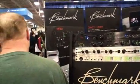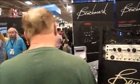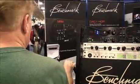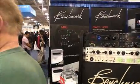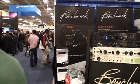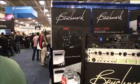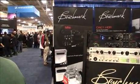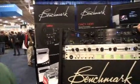Other products that some people may be less familiar with are the MPA1 and the Pre-420. The MPA1 is a two-channel microphone preamplifier with step gain — it goes all the way from unity gain to 74 dB of gain with no pads, up to plus 28 dBu on the input when running at low gain, so lots of headroom. It has a 500 kHz bandwidth.